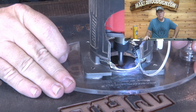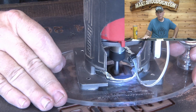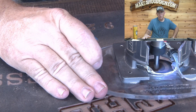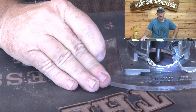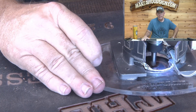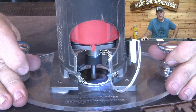Next it's time to do the one-inch inset letters. My general go-to when doing Clarendon inset letters — especially one inch or above — is my 60-degree V-groove bit. I love this bit for one inch or above inset letters; it gives a really nice look, nice and wide. I'm somewhere just slightly over an eighth of an inch deep on these one-inch letters.